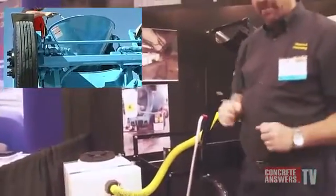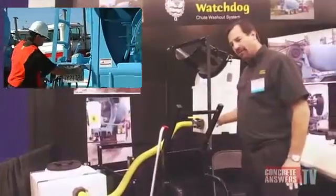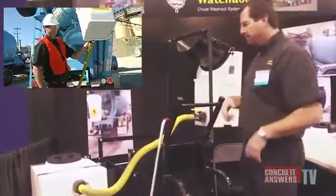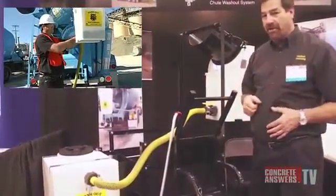I'm going to go upstairs, wash down my fins, and wash everything from the unloading hopper. When I get back, this bucket's going to be totally drained. I'm going to tilt it so the last little bit of water comes out, shut off my valve, unhook my hose, take my bucket off, put it back in the rack, and I'm done and ready to go down the road.